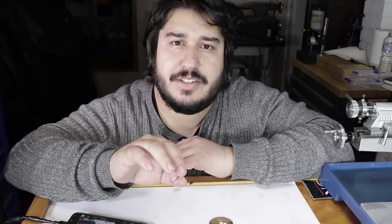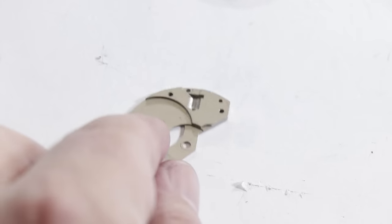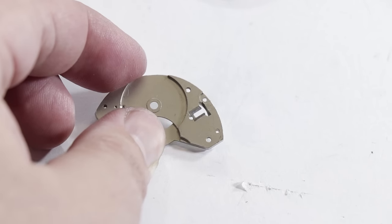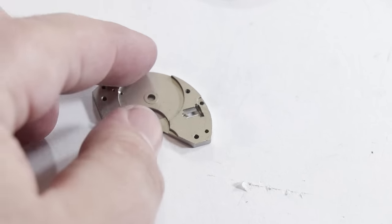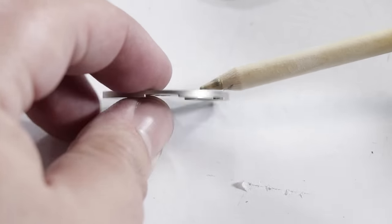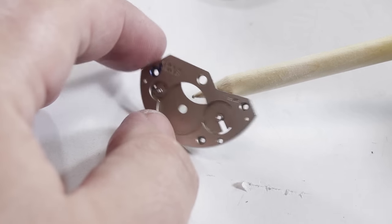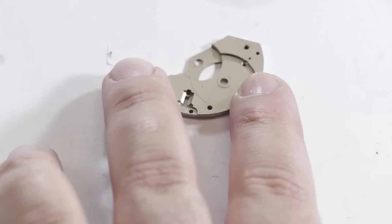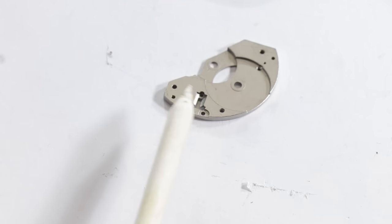Probably the biggest challenge is a quarter circular recess, which you can probably see a bit better now. It has very square edges, so it's not like a ball nose end mill that was milled from the top, and you can't really end mill from the side of the plate, as the edge of the bridge is actually higher than where the recess is. I have one tool in mind that could work. I'm not really sure. I'm going to test it out next week.